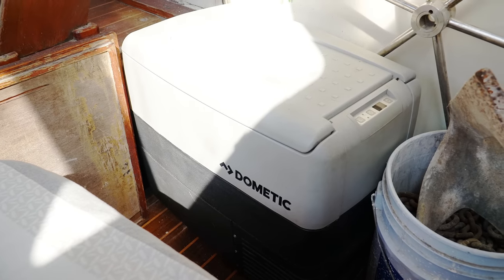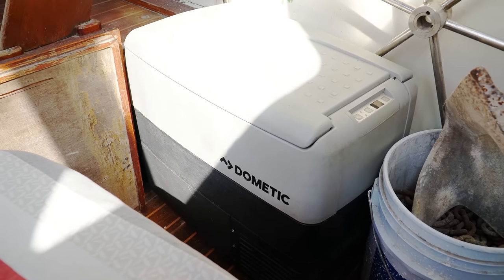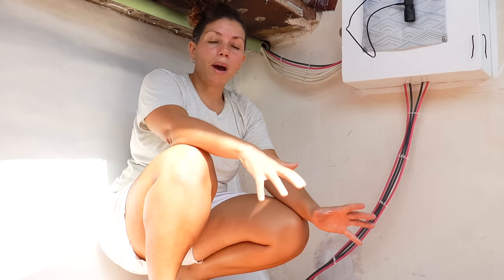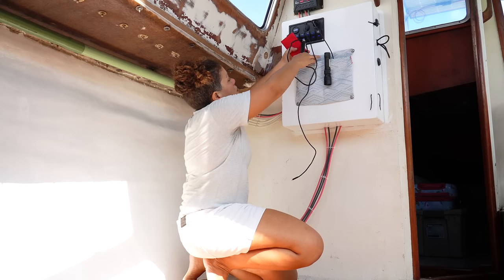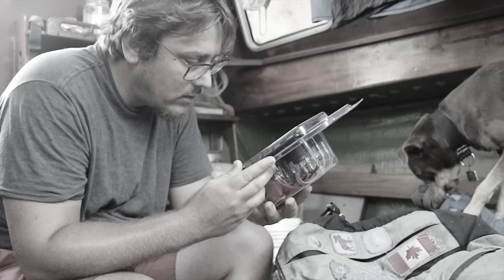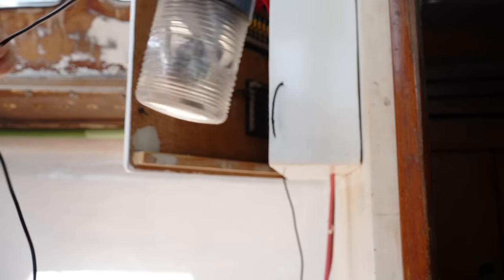How did we mess up our battery? Well, we tried running this Dometic 12-volt fridge on it and it couldn't handle it. Moral of the story: don't have one 12-volt battery — it will not handle your old Dometic. Our solar panels could, in theory, provide enough power to run a chart plotter, our laptop, our phones, and if we had more battery, we could use our mini inverter. Despite our patrons and supporters sending us all the materials to create this wonderful electrical system, we have struggled to gather the one last component — the batteries — to complete it all. The one battery can barely handle a couple of hours of one light before the display drops quickly below 10 volts, killing what remains of our battery.